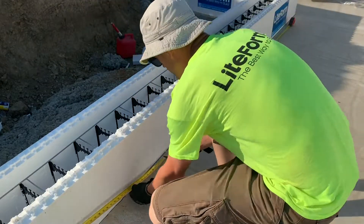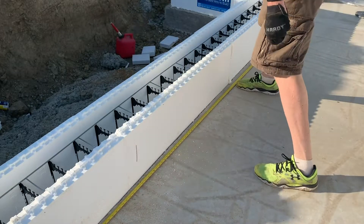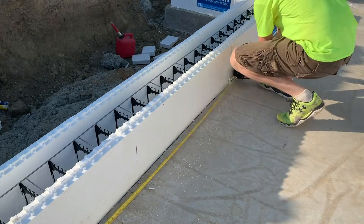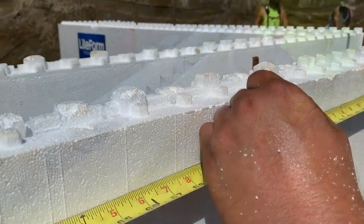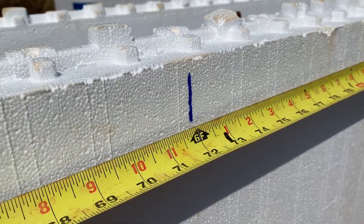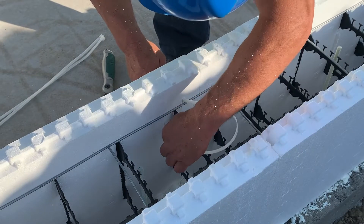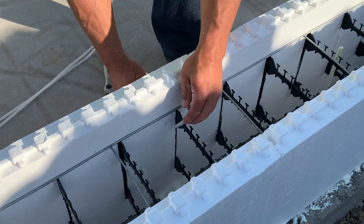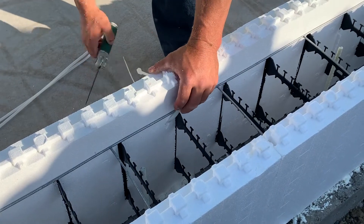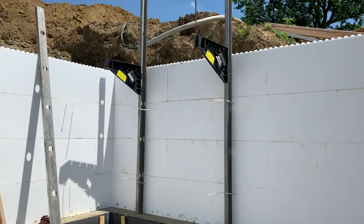After the first course of forms have been placed and glued, mark the locations for door bulkheads and the position of the exterior vertical form braces. Vertical form braces should be placed 6 to 8 feet apart along rows of spacer ties. Wherever a vertical brace will be located, a 24-inch zip tie or wire is pressed through the form and wrapped around a top spacer tie and in-wall bracing so the tie extends out. If the braces will also be used to support a work platform, braces should also be placed at the corners.